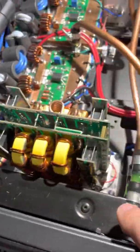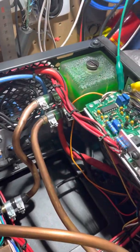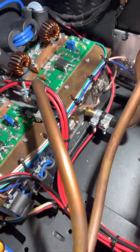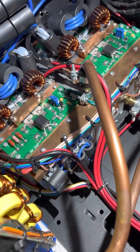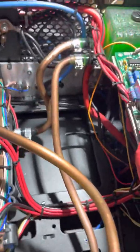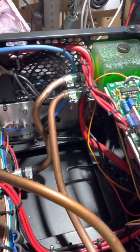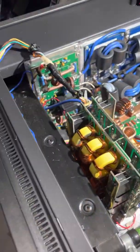You've got a fairly decent sized radiator — it's 240 mil long. We're running a computer water pump there. Down here I made my own water box, so there's a substantial amount of water volume in that box. It really takes a long time to get this thing to heat up, and with the radiator it's very efficient at getting rid of that heat. So I'm not really having heat troubles with it.